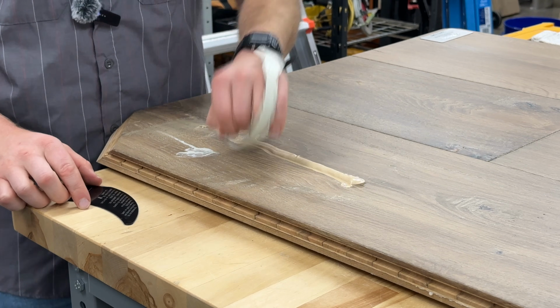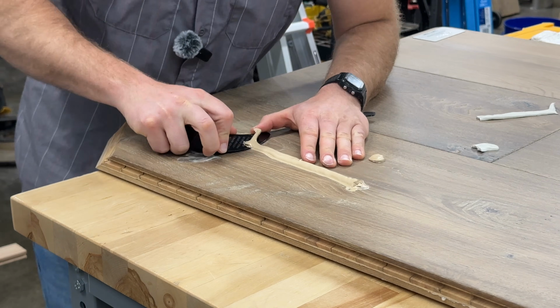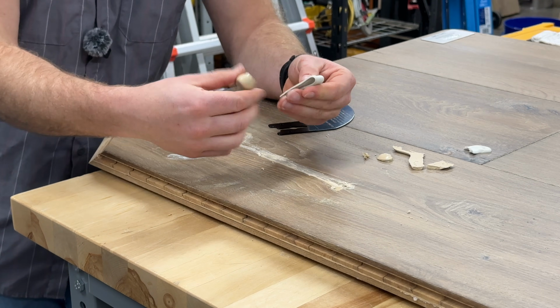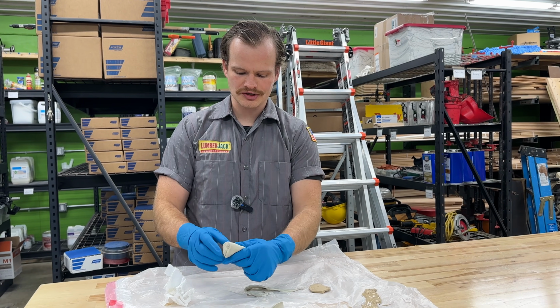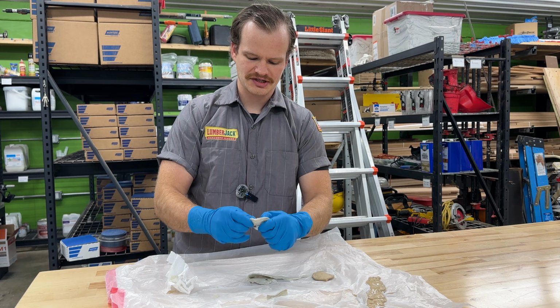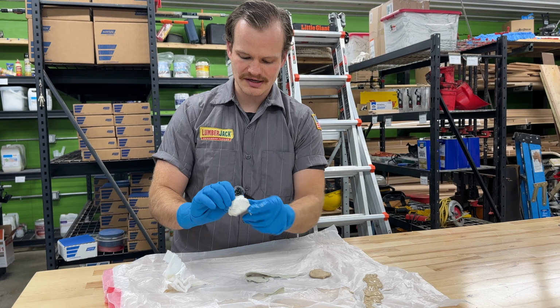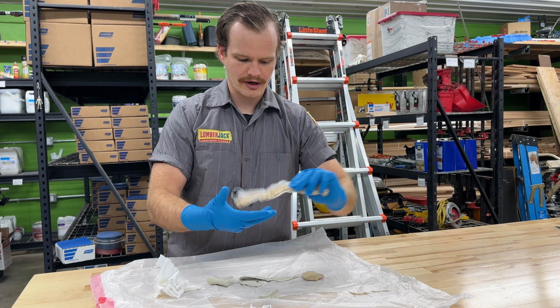Here we have 2 types of adhesive. The light stuff on the left is liquid nails, while on the right we have a specialty wood flooring adhesive from Berger Seidler. While the liquid nails is still rather malleable, you can tell that when it gets stretched, it just loses all of its strength. And it doesn't have that spring back to it at all, like the wood floor glue.